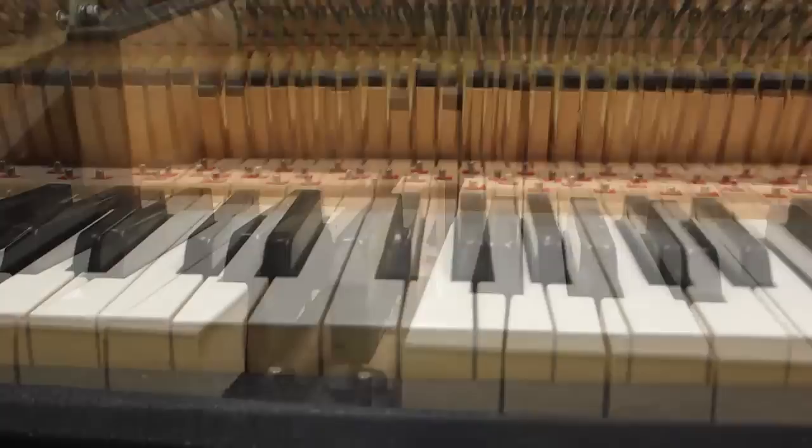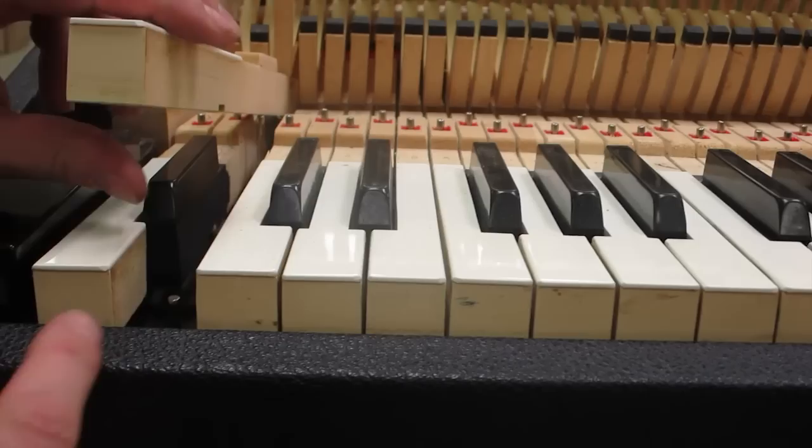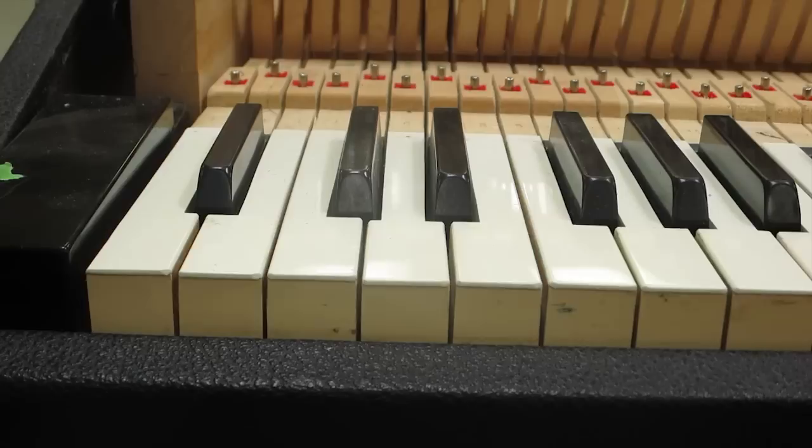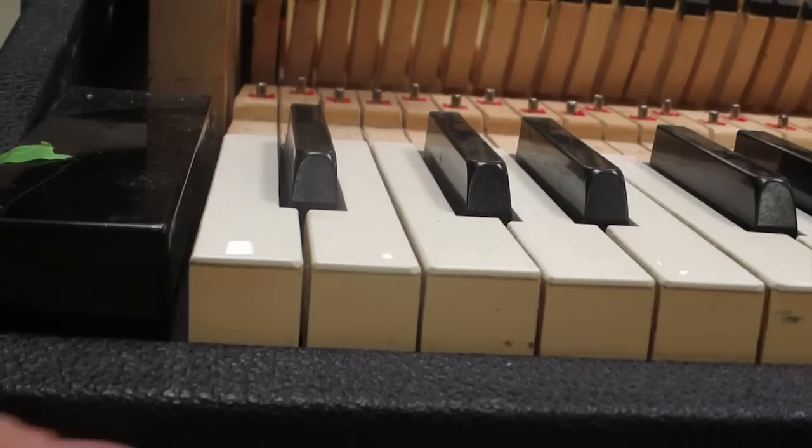We're continuing to determine where we want our key height on this particular piano. As I stated before, we just want to make sure that no matter where the key height is, that we're not contacting the front rail felt. And on this piano, we're going to go with the low A here. First thing we want to do is square it. We want to make sure that that key is completely parallel to the key slip, and this area here would be considered the key slip.